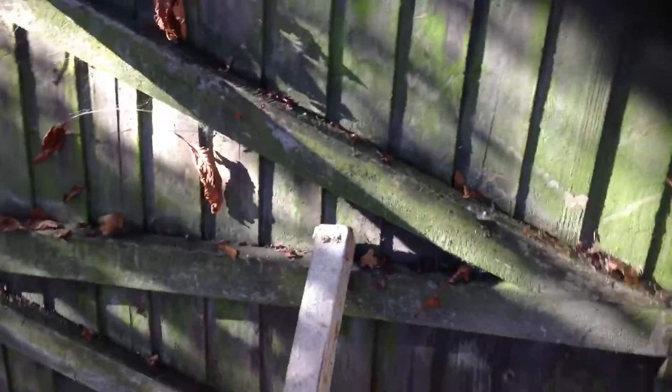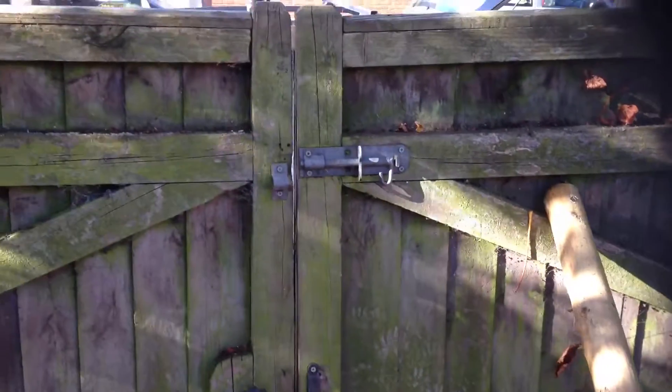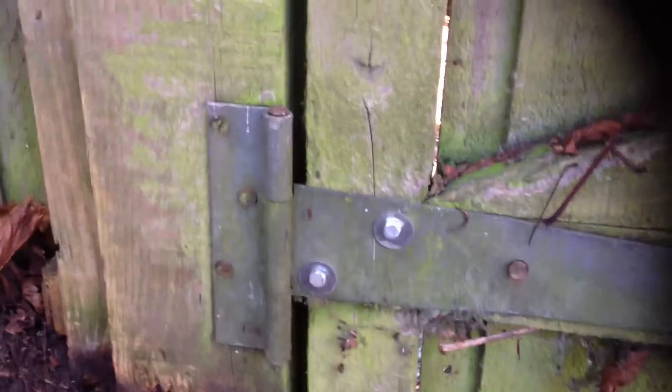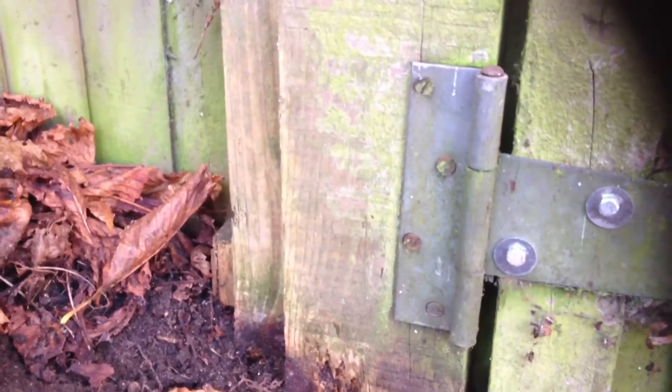I'm not too terribly unhappy about it, but I should have paid more attention to the size of the post. So now I had to repair this side first. Down here I used lag bolts to replace a couple of just wood screws that were in there, and that's going to need some repair work. I'm going to treat that with some wet rot wood hardener — maybe we can get it to last a little bit longer for the customer.